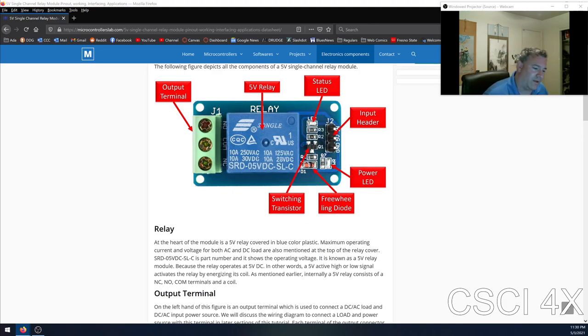So the right way of doing motors when working with a Raspberry Pi is to have a separate power circuit for it. Typically when you have a Raspberry Pi working as a controller, you're turning GPIO pins on and off, you're reading from sensors. Those things are just being used for control. In other words, you turn on, you turn off, that kind of stuff. You can power an LED directly, but for anything big, you're not going to power a motorboat from your Raspberry Pi, you know what I mean? But the Raspberry Pi could be like, turn the motorboat on, send a voltage high.